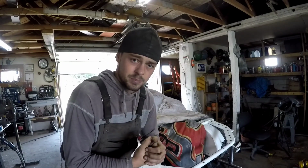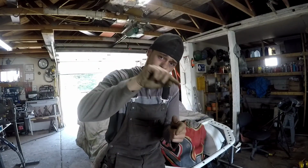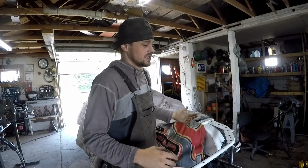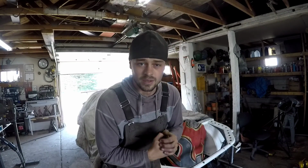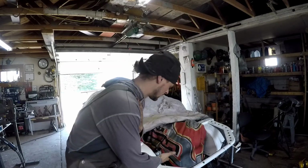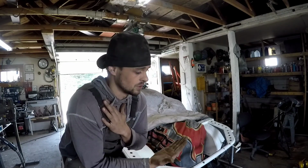If you were to take a piece of skid pipe, grab both ends and bend it, it will make a perfect U. If you take a piece of DOM and you start bending it, eventually it will just start separating on the top. It's not as malleable, meaning in impact it's very hard. It takes a lot to move that, and the rest of this car is going to, from now on, be DOM. I was building off this tube front, like I said, another client had, and from the get-go I should have removed this. So that's my stupidity, and now I have to address that.